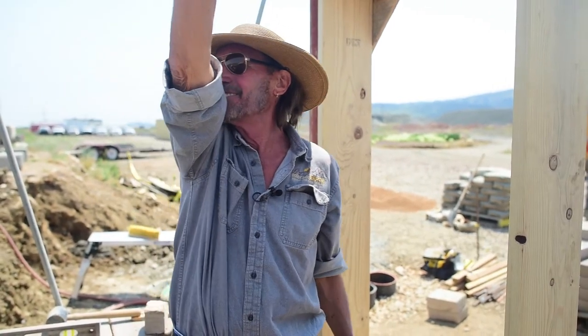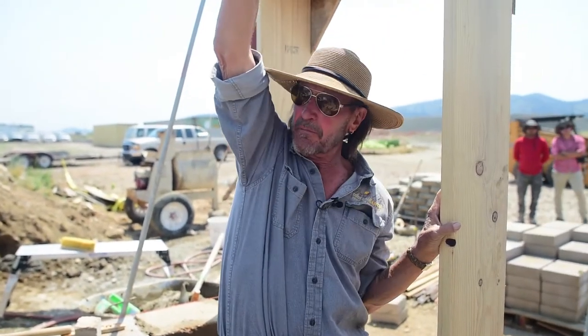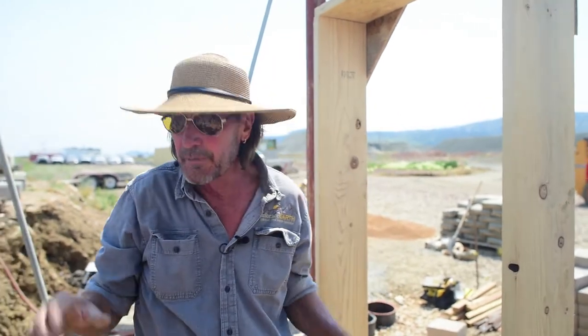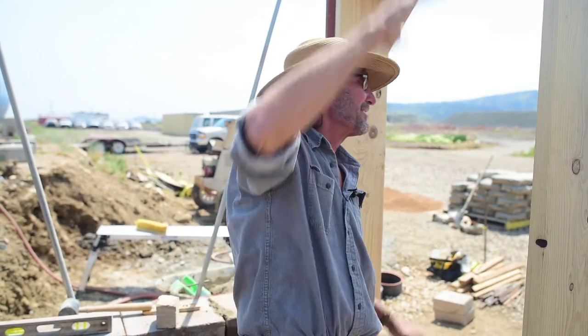One thing of increasing popularity, which is kind of a pain for us, are sconces — because those lights are out in the middle of the wall. Typically in that case we go all the way up, through the bond beam, and then come back down to the sconce. Going through the bond beam is something we'll mention again when we get to that. But if you've got penetrations going up — either for electrical wire or plumbing vent pipes — make sure you're reading your plans. When you form up the bond beam, look at the plans and put a PVC sleeve in the bond beam before you pour, so that the hole's already there. If we don't do that, the electrician or plumber's got a roto hammer drilling holes in the bond beam.